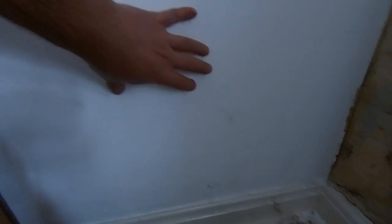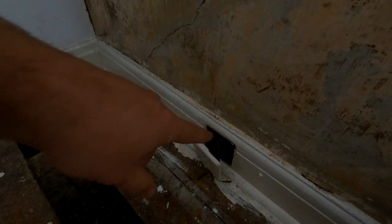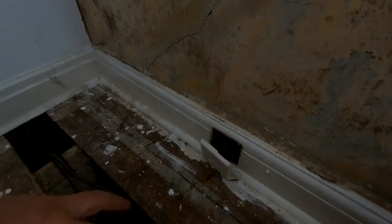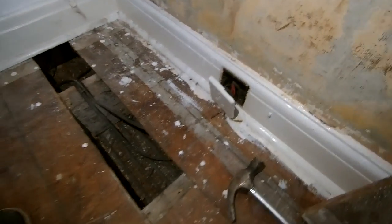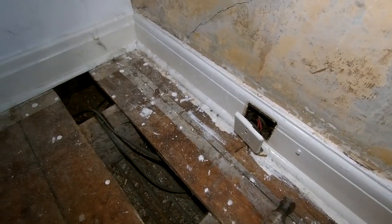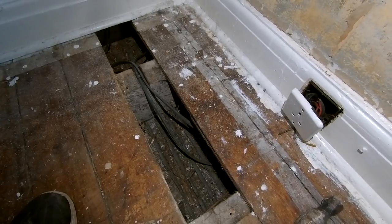What we're going to do in here - this is like the side of the bed - so you're going to obviously have your bedside table, so we're going to put plug sockets into this wall. When we do that, we'll take our new cable that we put into this socket and we'll just pull it up and connect it up to the socket we've got on here. So what we'll do first, we'll disconnect the wires from this plug socket and we'll find out which one of the two wires is coming from the little room.